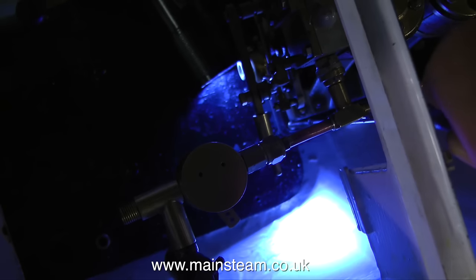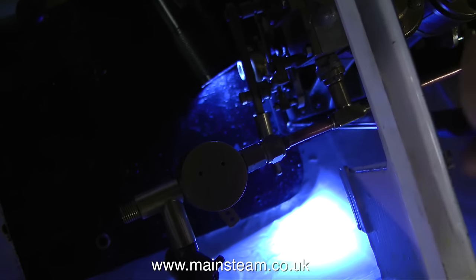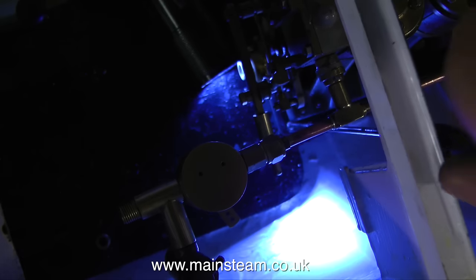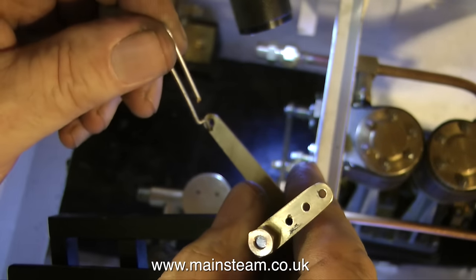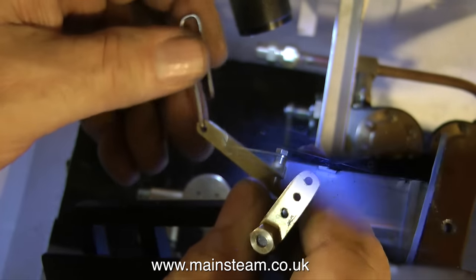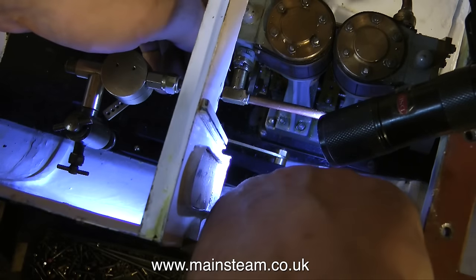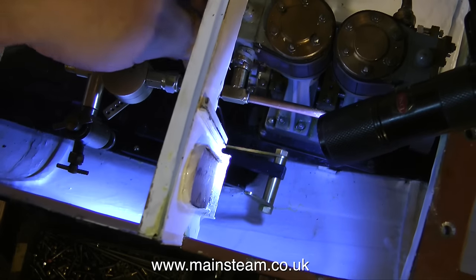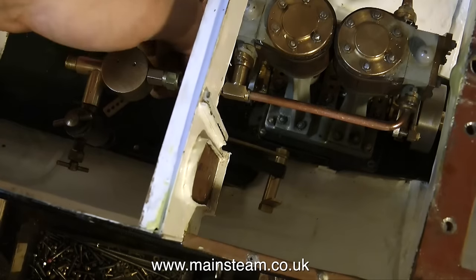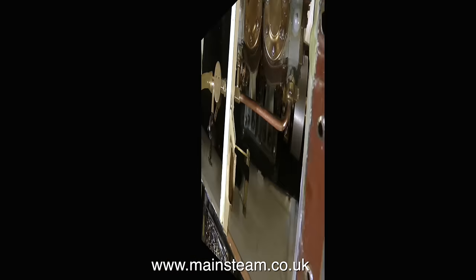Another shot with the little torch — these are really tiny. The screwdriver will not go in at exactly the right angle, but in the end the bolt's nipped up quite nicely and everything is fine. Now if you think that was bad, you want to try doing this. This is the arm I made in a previous episode, and it controls the reversing mechanism of the engine. It's just a rocking lever — a bell crank, I believe it's called — and the radio control will connect to one arm, while the other arm, via a special piece of bent wire, moves the reversing mechanism up and down.